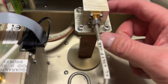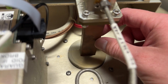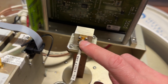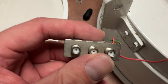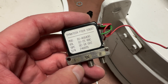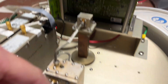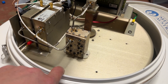The thing I'm most interested in is this — the feed. It's an SMA to waveguide transition. Not quite sure what size this waveguide is. For terrestrial use, I've got a little coax switch that operates off 12 or 24 volts and I can stick that there, then run a transverter. I might install a DB6NT transverter in the back here, although they're rather expensive. If I leave the cover on the back then it's sort of waterproof, and I can stick this outside and run all my leads back inside wherever I mount this.